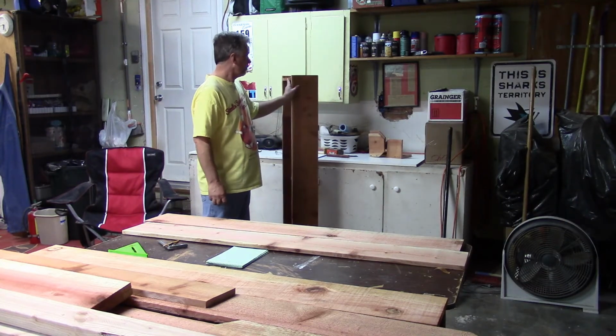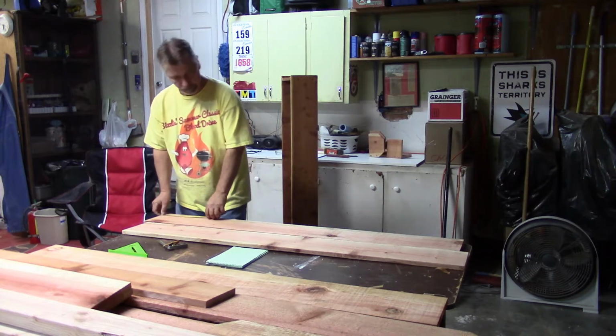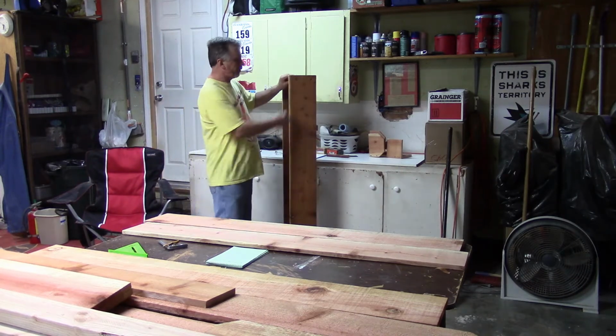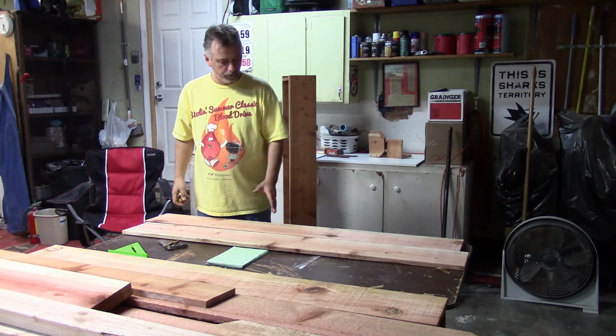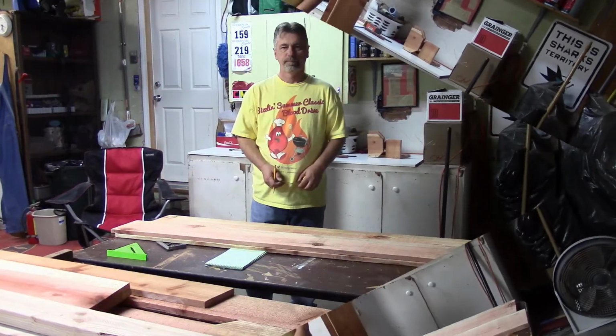The only thing about this one, and let's see from here to here, 1.5 inches, 1 1/8 inches. I'm 1 1/8 inches in. If you mess this one up though, you're going to miss the board on the other side with the screw. So that one's kind of critical. Other than that, do that to the two boards, and then we're going to mark the bottom.